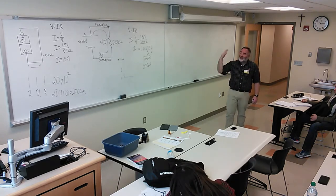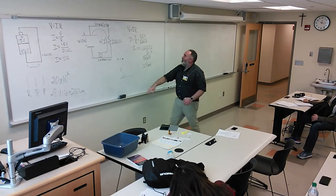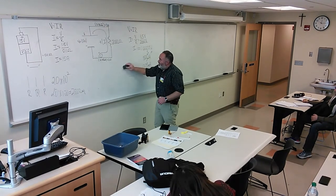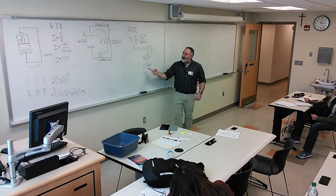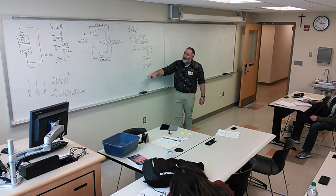It's just that when I start slipping into the current goes this way, I will try to be careful, though I might make a mistake. I'll be talking about the current flowing positive to negative, and I'll be talking about the electrons flowing negative to positive. Very good. I wish we could rewrite the world, but that's where it is. Okay, fantastic. So it doesn't really affect our calculation. The calculation, this value is still here. We don't have a negative in front of it.